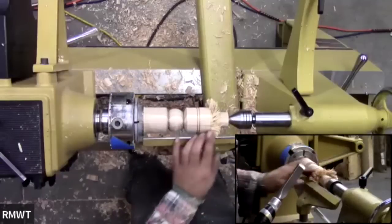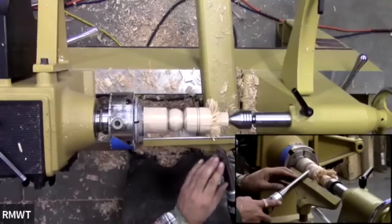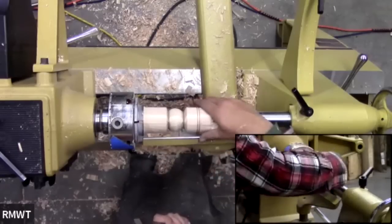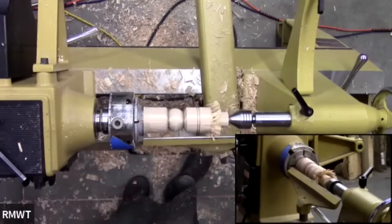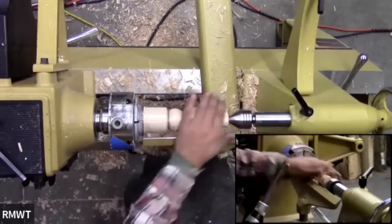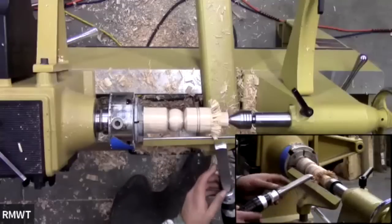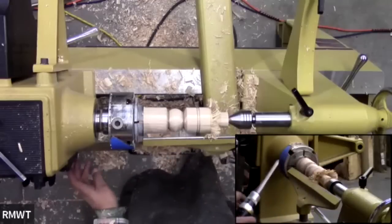What I want to do is, in this case, factually, we will actually lead with the long point and make a cut that will allow us to shear cut the fibers, the end grain fibers, that is. Here are all our end grain fibers, all facing out like this. What we want to do is clean that area up, okay? What we've seen prior, and then adding this to it, will be commentary on knowing how to work with the grain facing in this direction, as can be very clearly seen, and also working across the grain effectively, not just scraping it like that to create all that tear out, but rather leading with the long point to be able to clean that up effectively.